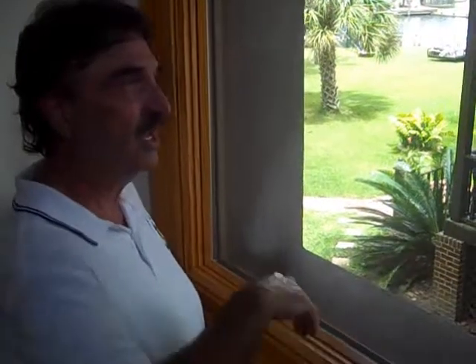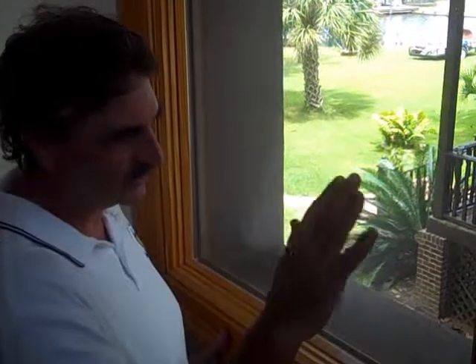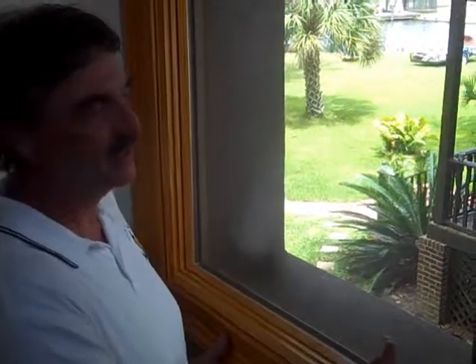Here's the other type of window treatment. The window is attached on the inside, and then you have a large finished area with stucco on the outside — or you can finish it out in brick, stone, or whatever type of siding your house has. Once you build a house out of ICF, you really can't tell from the outside or the inside that it's made out of ICF because you finish everything just like a traditional home. The thickness of the wall is what gives it away.